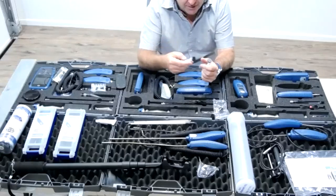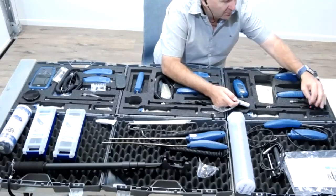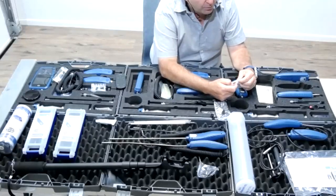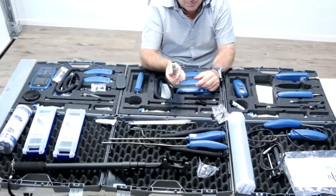With those pins, you've got insulated and non-insulated. The insulated ones are the blue or green pins, but the color doesn't matter. With the insulated ones, it only picks up from the tip. It doesn't pick up where the blue or green is. The non-insulated pins pick up all the way. That's especially important if you've got a wet surface, because you will always get a very high value with non-insulated ones, whereas with the insulated ones, you will get a lower value as soon as you get away from the surface. The more you hammer it into the wood, the better your value will be.